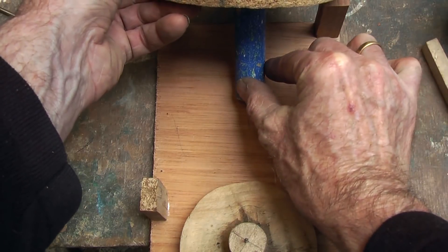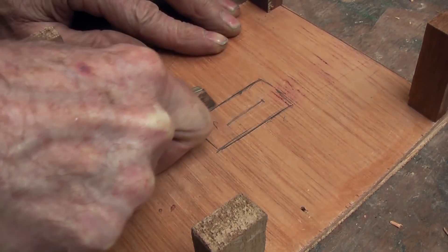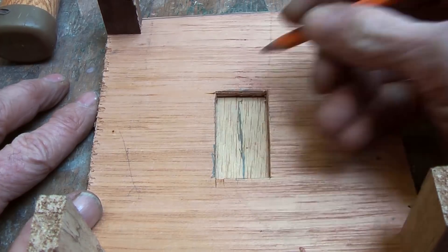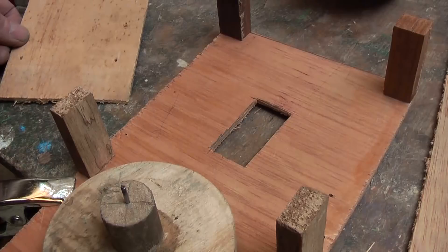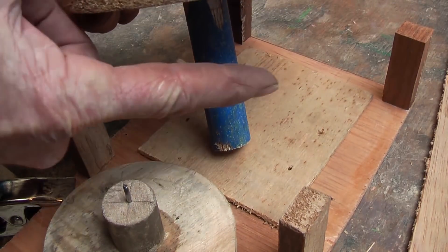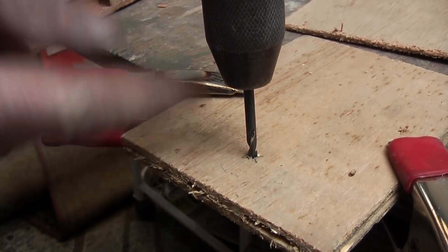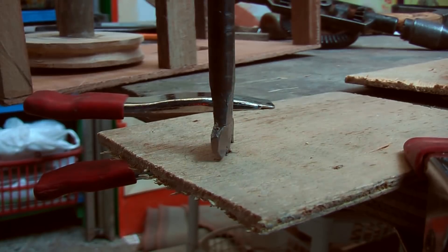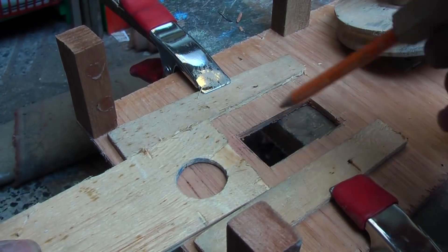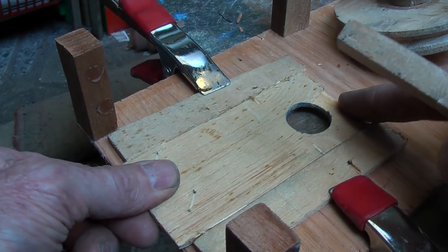So I need to make the hole as wide as the broom handle. Use a knife or a saw, and on the other board I am going to cut a groove to adjust the width of the axle down the middle, so it is able to slide up and down. Now, we will need an adjustment plate. We are going to need a hole there that the axle is going to go in, and that is going to slide up and down to adjust it. It is a hole through both of those boards in the same place, and a larger hole for the broom handle through just one of them. That goes on top of that large groove with the large hole. I have cut the two sides off this piece of board and I am going to glue them on so that it will be able to slide up and down without wobbling sideways.